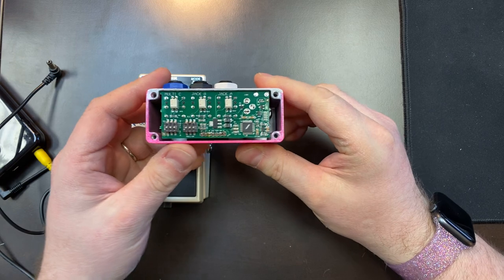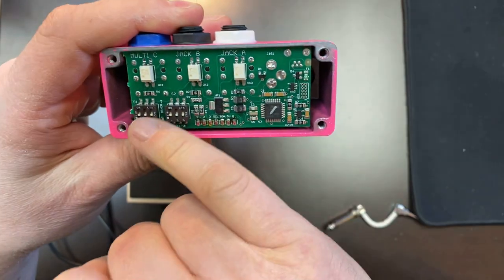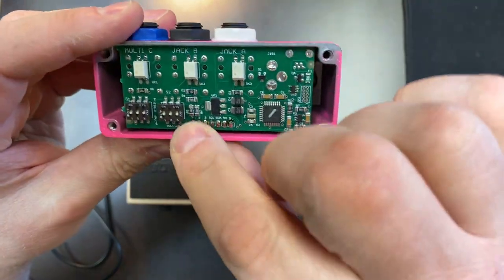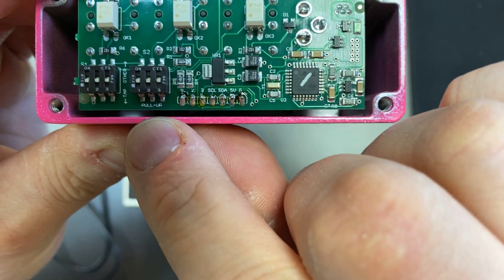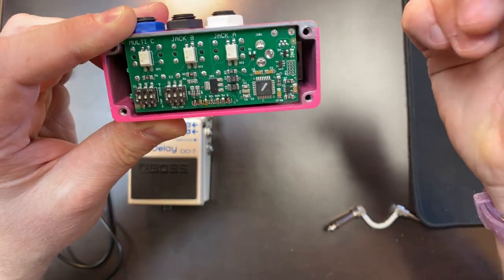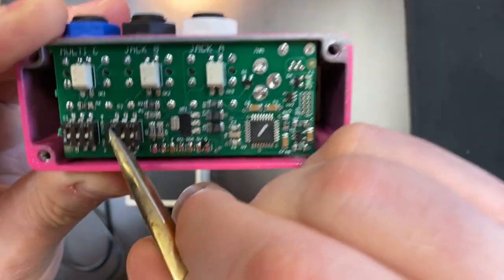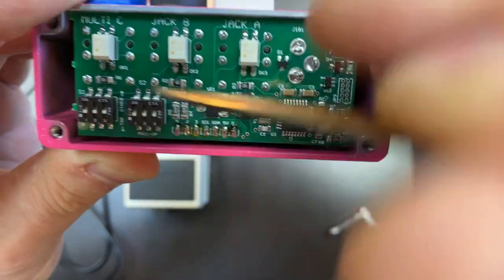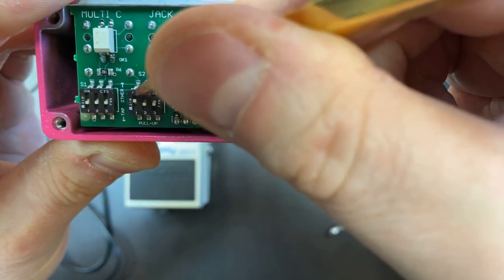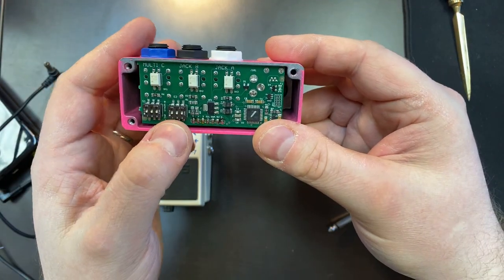The first thing you need to do is open up your Micro Clock and check out the DIP switches inside. There are six DIP switches in two banks. The left bank controls multi-jack C — we're not going to be using that, so you can ignore it. The right bank has a 'pull up' setting for special cases, not used for Boss pedals. Use a sharp implement — I have a letter opener here — and make sure they're all pushed down, which is the OFF position. If you're not sure, push them up; if they click, they were already down, so push them back. Get all of them down.